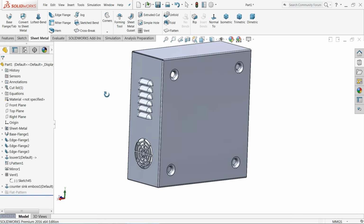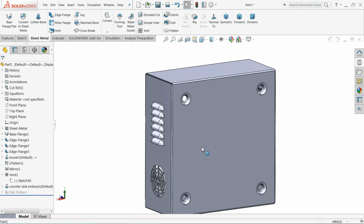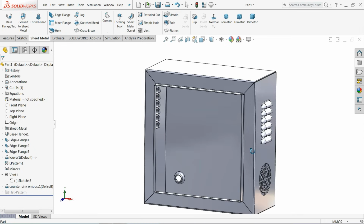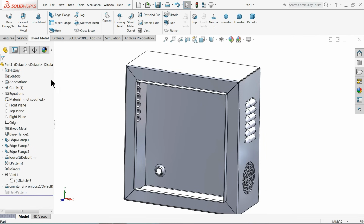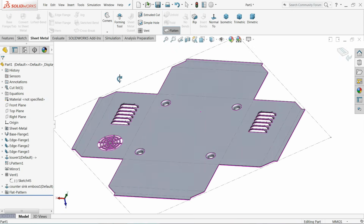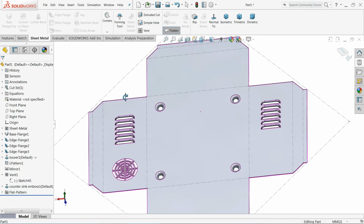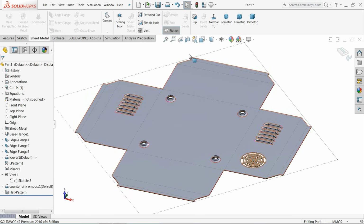See, these are the embossing holes. This is for fixing, not lifting, it is actually for fixing. Now those are the simple commands that we used. If you choose here the flatten option, just select flatten and it will be flattened. See, this is your flat sheet. It is ready for the sheet metal work. You can simply make the CNC commands and put them in a CNC turret machine and it will cut it. It is very easy.